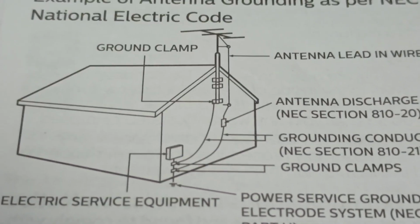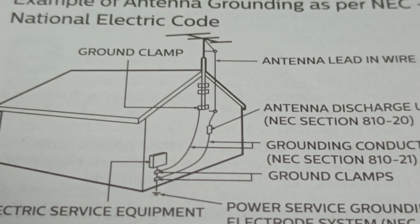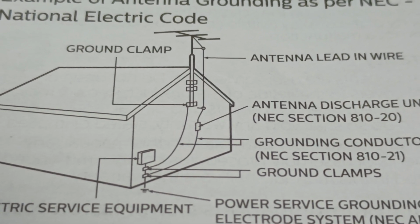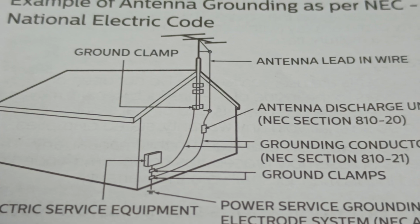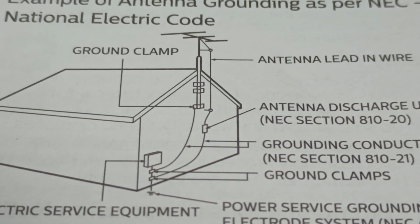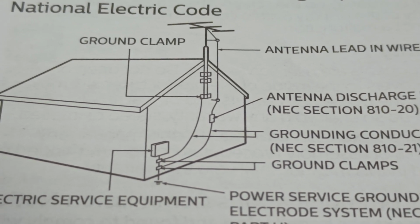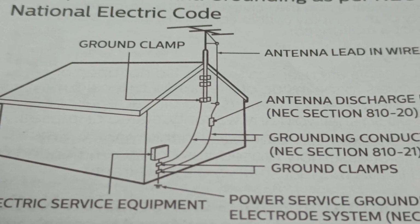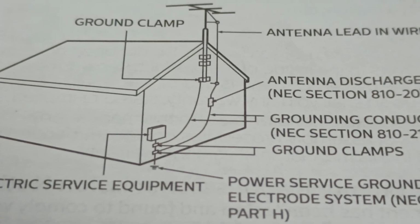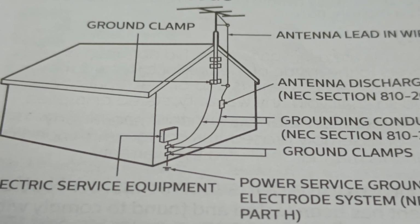Now, the screaming problem here is that it's difficult to impractical to actually do this, because it's also given that the antenna must be installed someplace where, if the top two clamps fail and it's only sitting on the bottom and it falls some radius, it doesn't fall on the power lines. That leads to the problem of the ground wires, which are typically number 6, being far too long and far too inductive to carry lightning current.